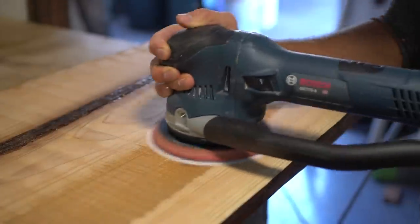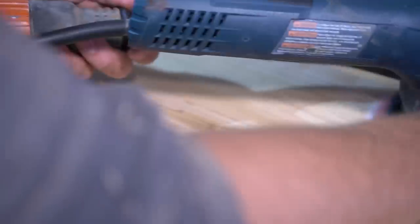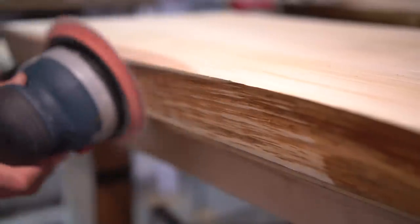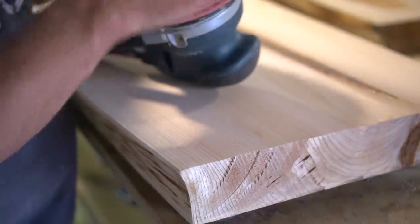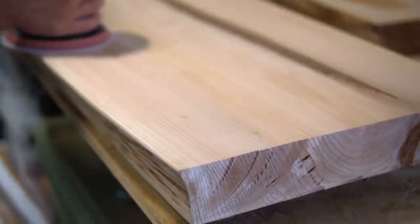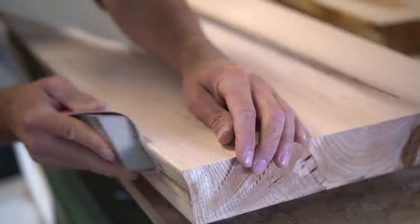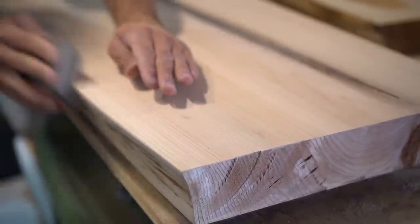I'm starting from 80 grit and going all the way up to 220. My main sanding pass is just to remove any of the router lines left from the planing. I'm going from 80 to 100 to 150 to 220 on the top, bottom, and the live edge front lip. The sides and back side don't have to be sanded at this point because we're going to be cutting it to size once we get on site. This Bosch Random Orbital Sander does an amazing job, but I always suggest taking a soft sanding pad with sandpaper for areas with a unique shape to get into tight crevices the orbital sander can't reach.